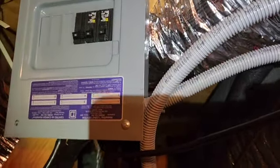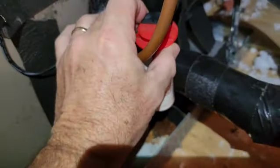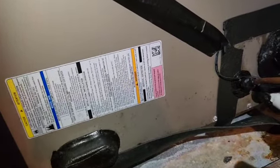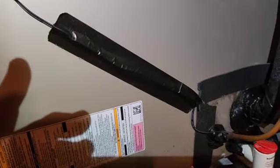My plan is: I don't want to open up this panel and get involved with all of the control panel and everything inside. I'm just literally going to splice this unit in line with the existing splice right here, and then I'll make a new splice right here. First thing we need to do is turn off the power to the air conditioner — this is a 60-amp circuit, you do not want to be messing with that. By turning off the power, I've also turned off that light and it's not coming back on. So I've effectively removed power to this system. It's going to be a very simple installation — I hope it works. We're just going to splice the wires of the new one into the old one.